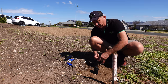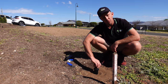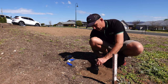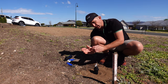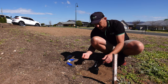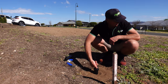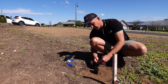So we start with the sprinkler. You can actually turn these in direction of travel while they're in the ground. Don't force them the wrong way, but you'll work that out. Start off on the right hand side, so as far right as it will go. That'll be your fixed point that doesn't move. Then we put our little key in here and we just turn it to plus or minus. Obviously plus will increase the arc or the radius, and the minus will be smaller, more towards a quarter or less than a quarter, etc. So let's just have a little adjustment there. That's going to go there and there. I've done this 1,000 times before, so that's pretty close.